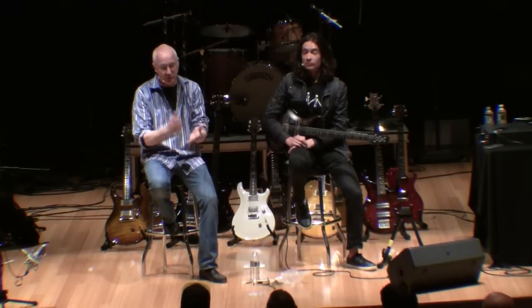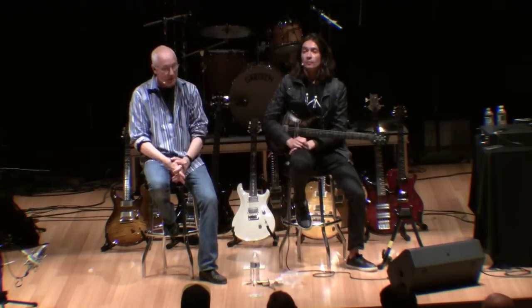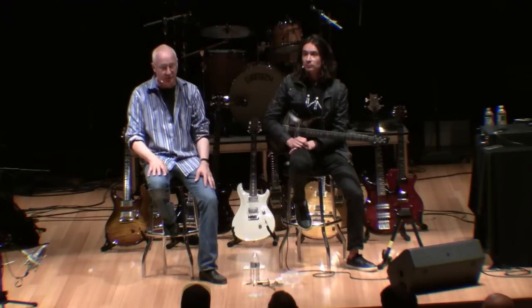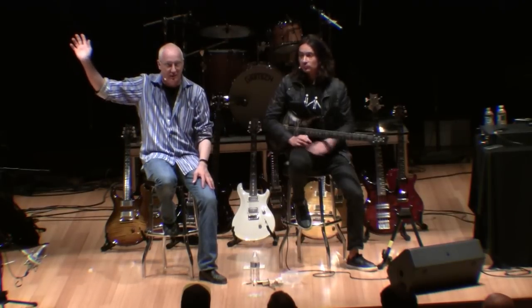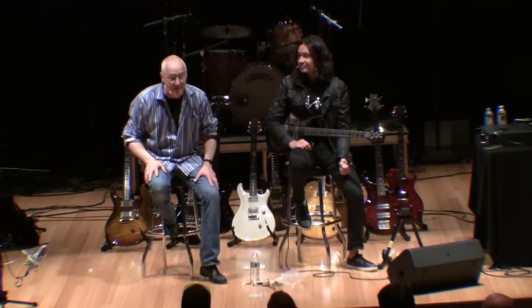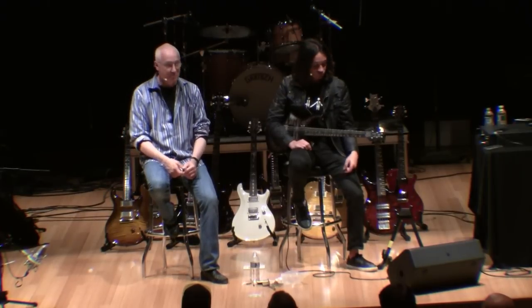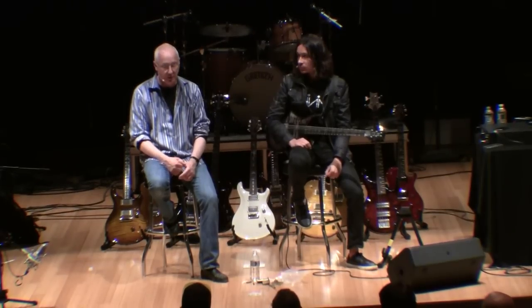Kiln drying used to be 7% water. Now it's 10%, 11%. In my experience, that's not good enough. The frets will stick out of the side of the neck after your first winter. Has anybody in this room had a problem with a guitar where the frets stuck out the side of the neck after the winter? That's because the wood shrank and the frets didn't. It's not okay. So kiln drying isn't good enough, and we have ovens all over our factory drying the wood.